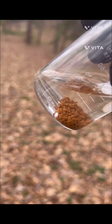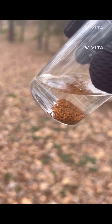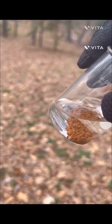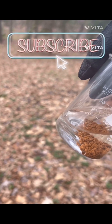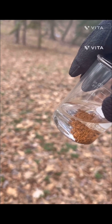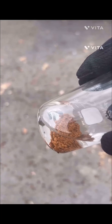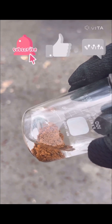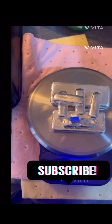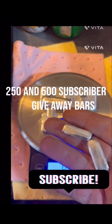We're getting there - might have enough for a little one-gram button one day. I want to finish up my pens and I had a little bit of foil left over, so next weekend I'll attack that. I washed it and I'm keeping it in distilled water for now. We'll boil it with hydrochloric acid again and give it an ammonia wash. It doesn't look bad - I really like that ferrous sulfate, it drops so nicely. These bars will be for the subscriber giveaways - stay tuned!